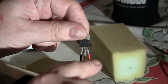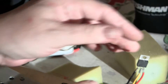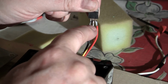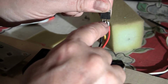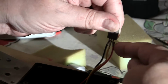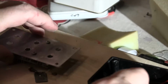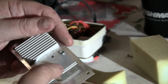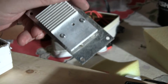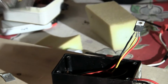And then the larger capacitor, the electrolytic one, will solder onto the output. You put the negative side of that cap, because the larger one is polarized, on the middle ground, and then the other hot side you bend in and solder over to the output. I've done that here so it can mount a little better, without those caps hanging and worrying about shorting on the aluminum. So anyway, thank you for joining me for this.